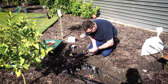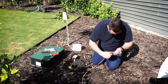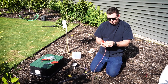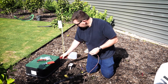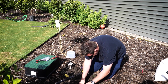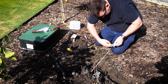I'm going to start wiring this up while we're waiting for that to dry. I'm going to leave all this cable here, like I did at the other part, because I don't want to cut it short in case we ever need to do repairs. There's no problem having a run of cable in the box. We're going to need a little bit more exposed cable on this part of the job than up near the controller. As you'll remember, we used blue, brown, red, and green, and didn't use white and yellow. The wire joiners we're using — the theory is that you don't need to sheath these cables, so I'm not going to.